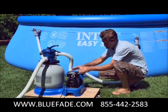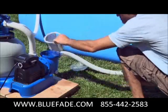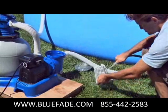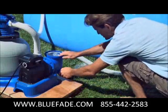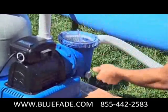Unscrew the leaf trap cover and O-ring. Remove the basket for cleaning with a garden hose. After rinsing the leaf trap and O-ring, reassemble them and close the sediment valve. With proper maintenance, your sand filter will give you many years of service.